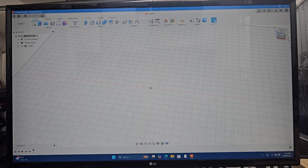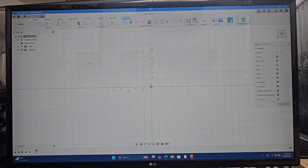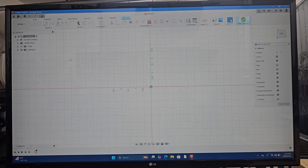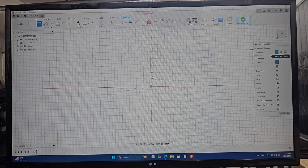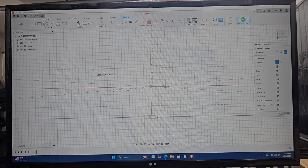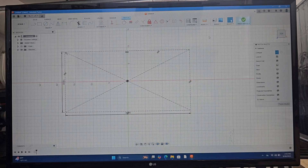Today we're going to be using Fusion 360 and these pictures we saved to generate a silhouette and ultimately make a steel sign that resembles the Kalakala. We've got Fusion 360 open. First thing I'm going to do is change my view to a top view. From here I'll create a sketch and select my sketch plane. I like to start by creating an envelope that I want the sign to fit in — in this case no bigger than 36 inches long. I'll create a rectangle with a hidden line from the center point of my sketch at 36 by 18, giving me the envelope I'll work within.